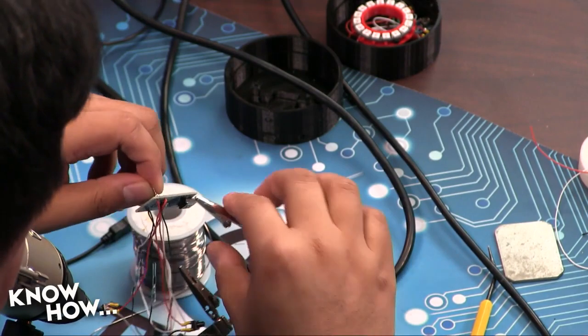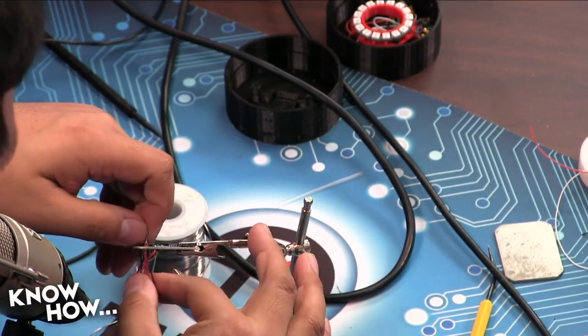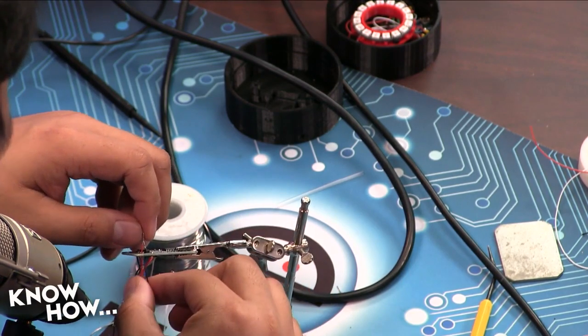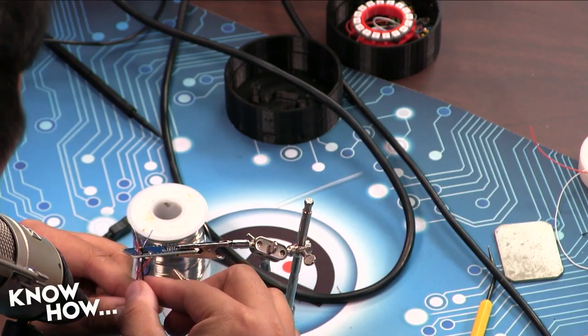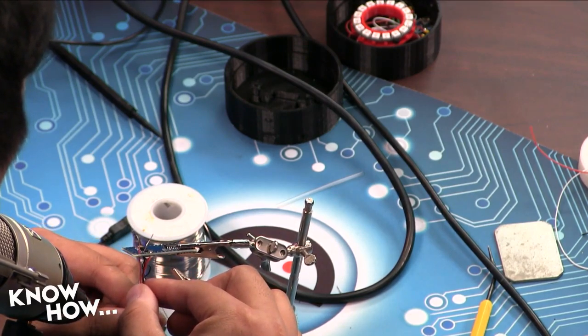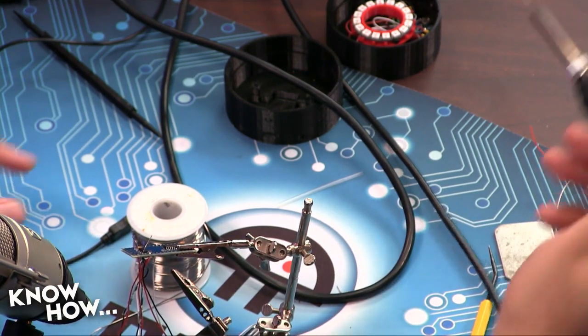Yeah, that confuses people every once in a while. They wonder why there's multiples. It's because they know that most people are doing projects like this, which will require multiple grounds, multiple voltage lines, and they don't want you to tie everything to the same pin because that just gets messy. There you go.